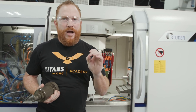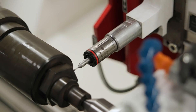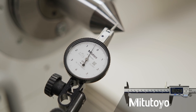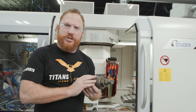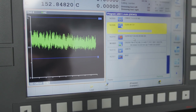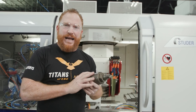Now when we're grinding, everything's on a smaller level — we're dealing with molecules being split almost, so you're not gonna hear a thing. Typically on a mill we're gonna be listening for those chips flying; we're not gonna have that because we're making such light cuts. So you're not gonna hear cutting sound the way you would milling.